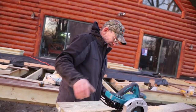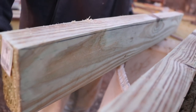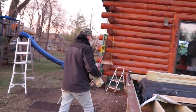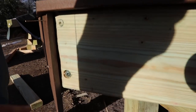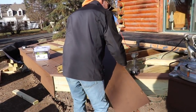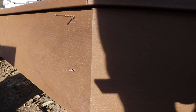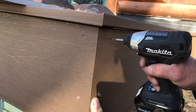That is really wet wood, but you can give Makita a plus on that — it went right through it. One of the lessons we learned: you can see these lag bolts — they have to be countersunk to get the board to fit flush on the face, because if they stick out, the board sticks out. You can also see where he's got to miter all the corners — you can't have a butt end in there. Anything that gets face-screwed will have the pinch and pull heat gun method done over the screw holes to make those disappear.